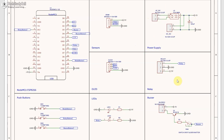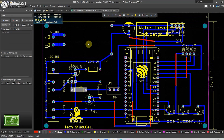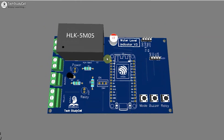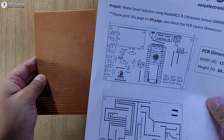The relay will turn on for the high pulse. And here you have to connect the buzzer, but during the booting process of the NodeMCU, this switch must be turned off. Then here you have to connect the ultrasonic sensor. To make the circuit compact, I have designed a PCB for this project. You can download the Gerber file from the video description. But in this video, we are going to make the complete circuit on the zero PCB with the help of this PCB layout.